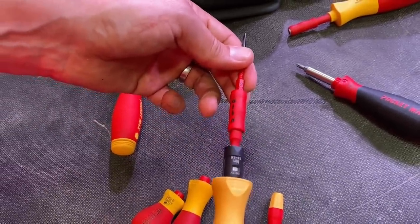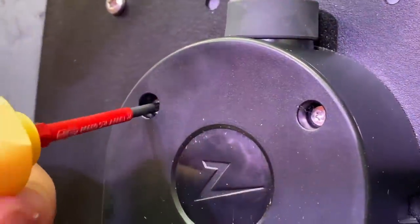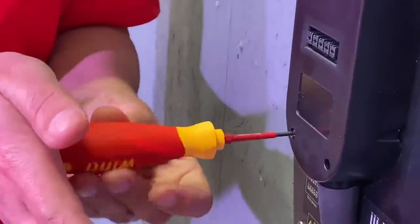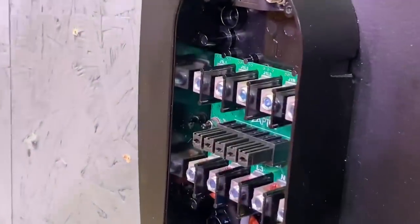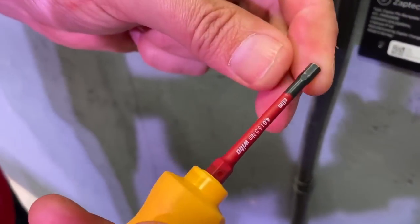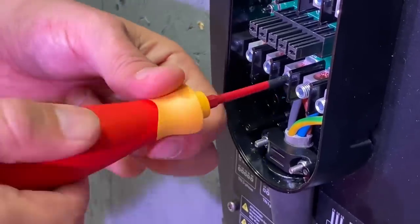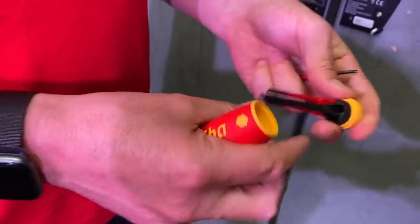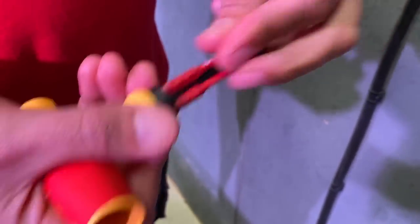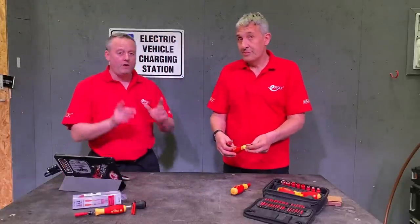Even if you're new to the range and don't have this extensive selection, there are still great advantages to buying this and adding some additional bits. When it comes to EV chargers — as we open up our Zaptek EV charger — these have got loads of different head types. We found this a lot with EV chargers: we tend to use Torx head screwdrivers, and here we've got the T10 bit fitted to get the cover off, to get inside the terminals, which use a 4mm hex head. In the past we had to buy additional bits, and if you're not using them all the time, keeping them inside this Pocket Max is a great place — just swap out a couple of the standard bits for the ones you'll need for that EV charger job.